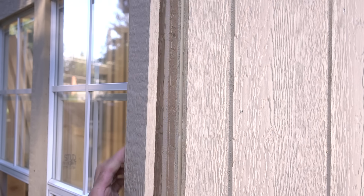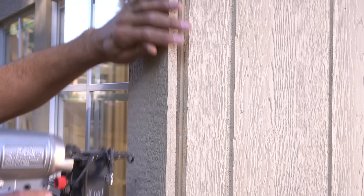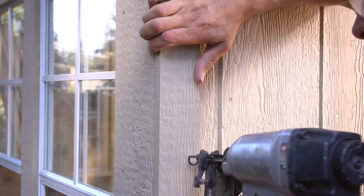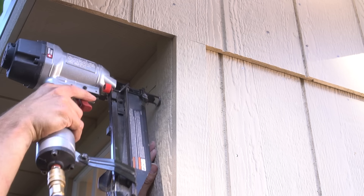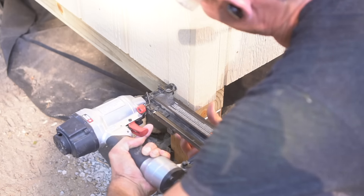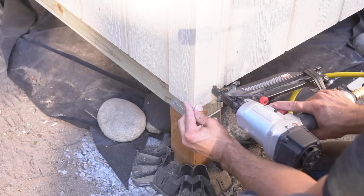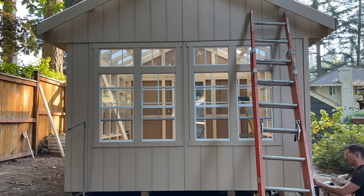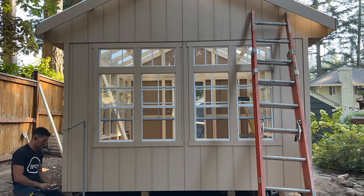The walls of the corners come together extremely well, but there still is a gap there. Luckily, with this kit it comes with made-to-fit trim at every single corner location. There is a tall side and a short side on every single corner, so keep that in mind — but as long as you know that ahead of time, you can easily install this with a finish nailer in a few moments. Before painting, I would caulk the seam where each piece of trim meets each other, but as long as that's taken care of, we're extremely well sealed at every single corner location.